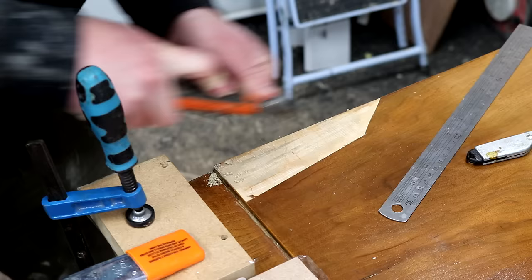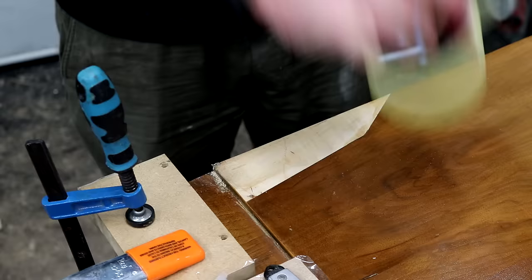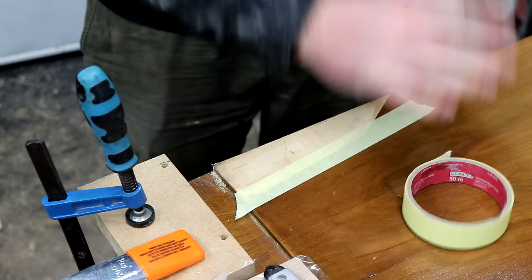As I have access to the substrate here I can scrape away the old glue before applying the new, which will give better adhesion. I'm using my carbide scrapers here and these will be used a lot in this video. You can find details for these in the my tools link in the description box below.